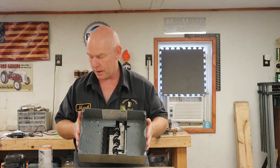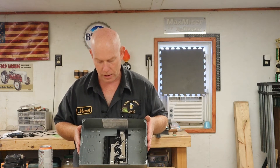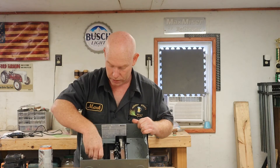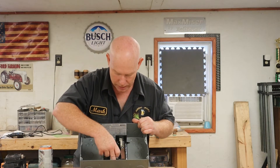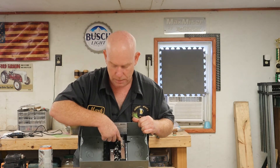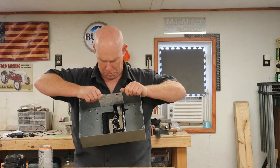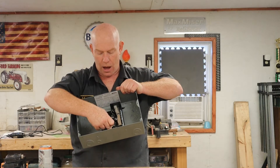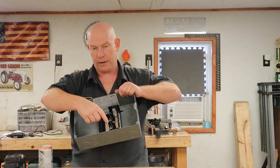The wiring that's going to come in here — you need to buy a separate grounding bar to screw in here because they don't put grounding bars in the panel; this is a neutral bar. These are going to be your main power bus bars. You're going to have a hot wire here and a hot wire here, and as you can see, they alternate.